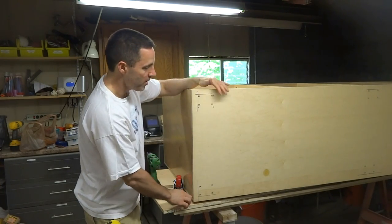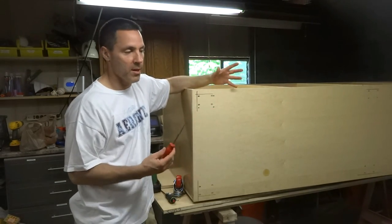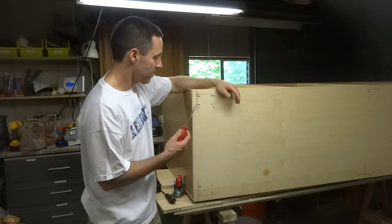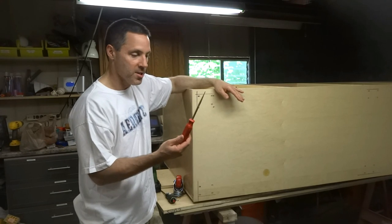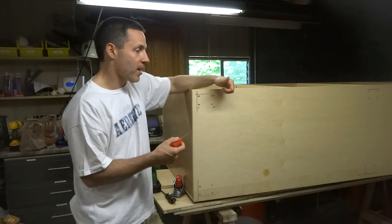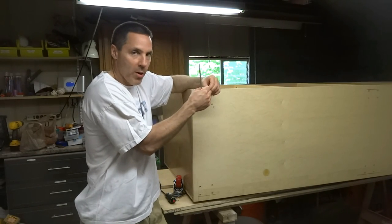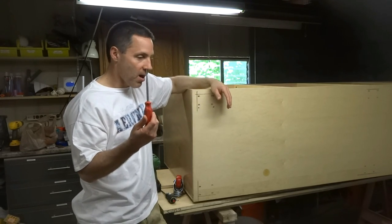And so now I do a couple things. I want to drill a pilot hole into each of these holes for all the wheels, simply because it's easier to drive the screw in there. I'm going to be driving some pretty heavy screws, so I think a pilot hole is warranted. The next thing I like to do is take this scratch awl, which just looks like a screwdriver with a point on it. They have automatic ones, actually spring-loaded ones, which are pretty cool. But again, a couple bucks or whatever, and you can go buy drill bits with brad points on them too. That helps the drill bit from wandering. But basically, that's partly what the awl does.